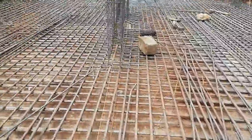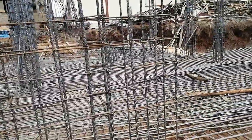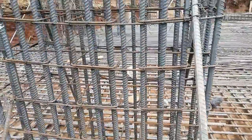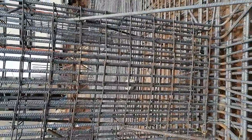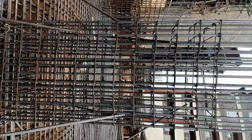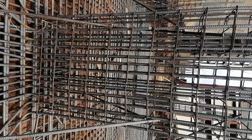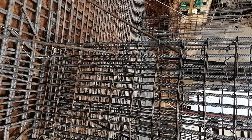Let's check out one which has already been finished. From observation you can see quite much has been done. This one here is fully finished as you can observe. It has already been fixed. What remains is aligning it in the correct position to ensure it is vertical, and then you do the formwork and you pour your concrete.